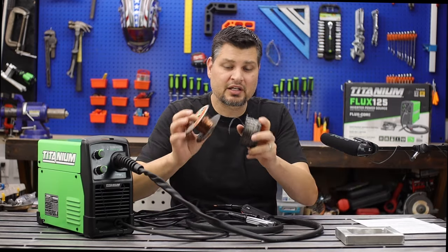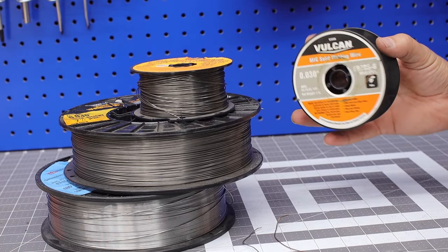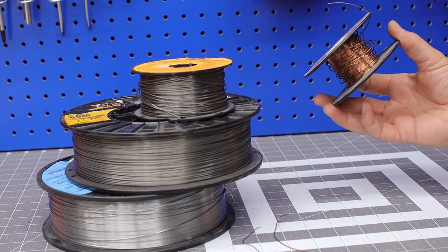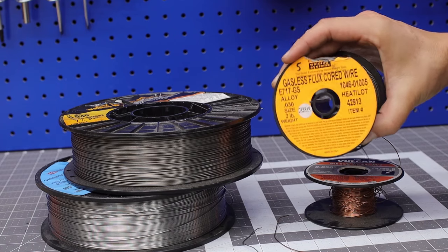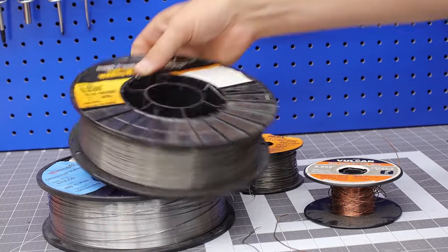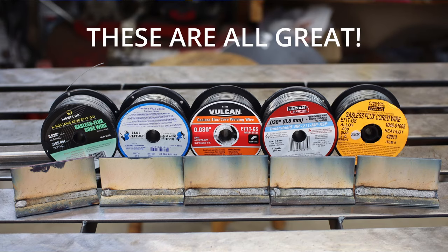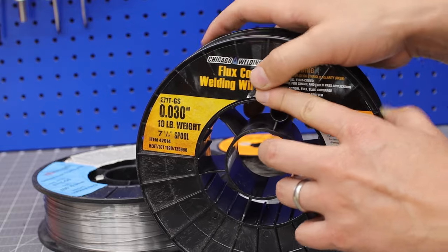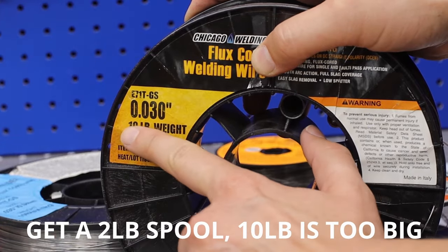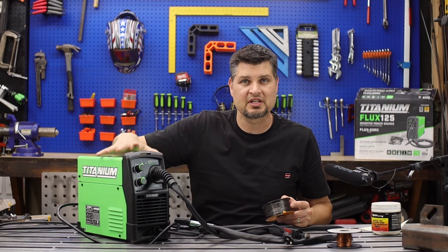You do need to buy the right wire. Not solid core wire — the shiny copper-looking stuff is for MIG welding, and we can't MIG with this machine. You want the gasless flux core wire, also called inner shield wire — it goes by many names. It's the non-shiny, more expensive wire, but you don't need gas. Pick up 0.030 size and that will get you through almost any project you'd do with this machine.